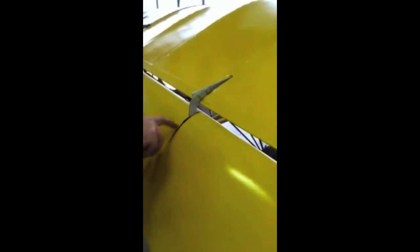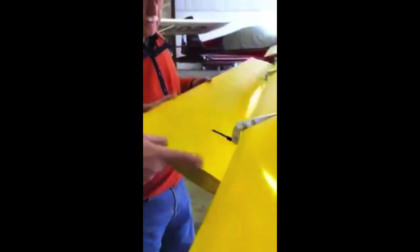As soon as you pull it out, keep this thing supported so it doesn't just flop down. The reason you don't want it to flop hard is because this is what happens. This has been left as a project for you — putting it on adds a slight amount of weight. What we've done is cut some nice aluminum and riveted on a trim plate that completely hides all the boogered-up areas. When we put on the doubler, we threw in this bolt, and that cutout right there was to allow the bolt to clear through when the wings come up — and they do have to come up.